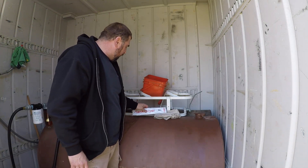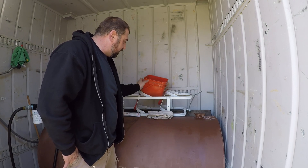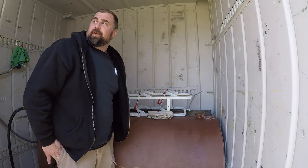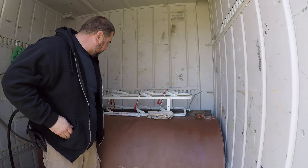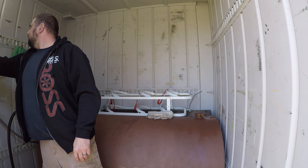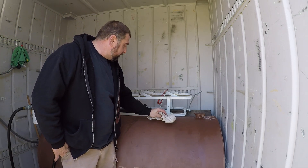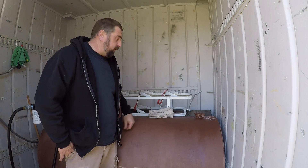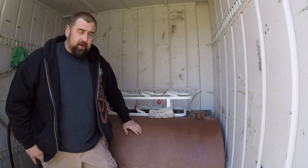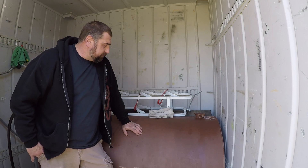Try to keep zero water out of your fuel with this new equipment — the high pressure common rails and all that. Don't just get diesel fuel and think you're good to go, because you'll have water in there. Equipment nowadays is expensive. Even my older stuff, like my Duramax, is still common rail. Pretty much all our equipment runs high pressure common rail, so you can't run a bunch of junk in that fuel. Fuel is so refined nowadays.